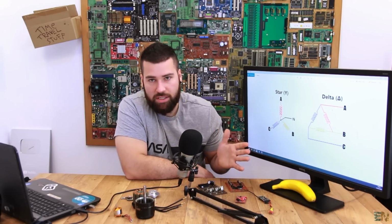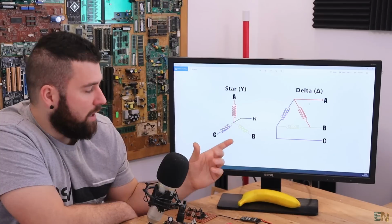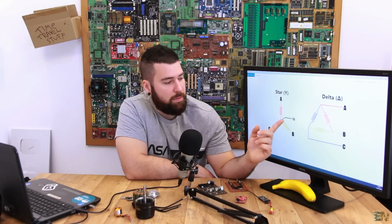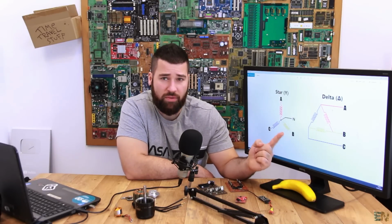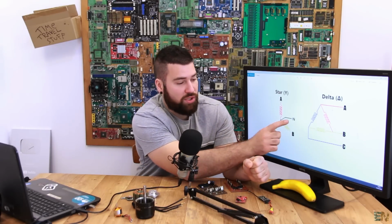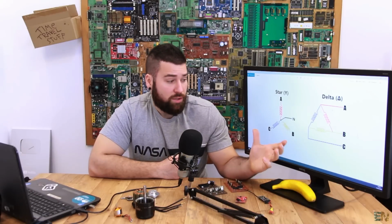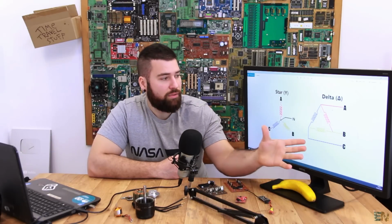It's okay for any kind of brushless motor, but in this podcast I will explain the theory only for the star shape. As you can see, we connect A, B, and C, and then we have a common connection, which is this one here. Sometimes this is called N, or sometimes COM, the common connection. We can use this common connection to detect the position of the rotor, because by comparing the voltage on each coil when it's floating with the middle position, which is the zero value, we call this the virtual zero, we can detect the position of the rotor while it moves inside the motor. So it's very important to know that we can wind these motors in the delta configuration or the star one.